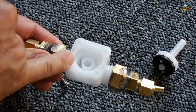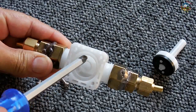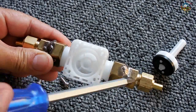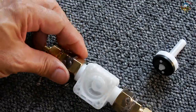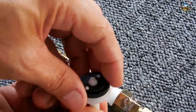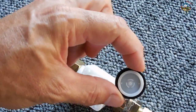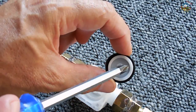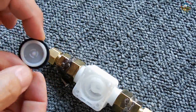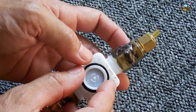On the inlet side you're going to see a wire sticking up right there. This outer ring is where the inlet water is, and the opening in the center is the outlet. If you take a look at the plunger, there's a pinhole right there, and in the center of the disk is another hole. That little wire goes over that hole.